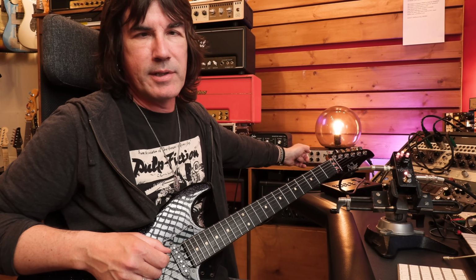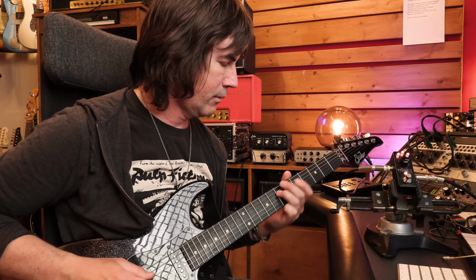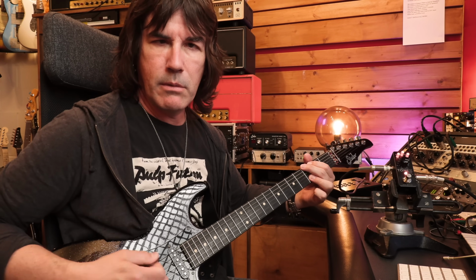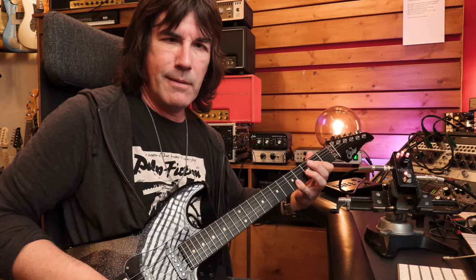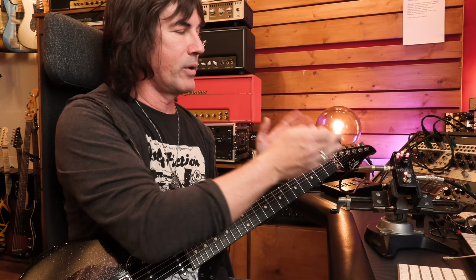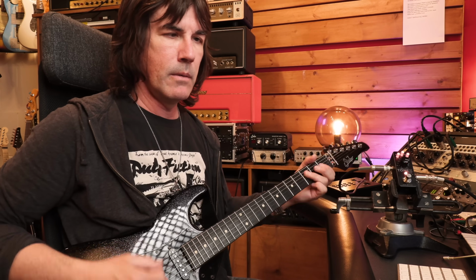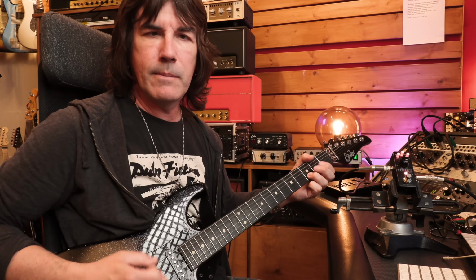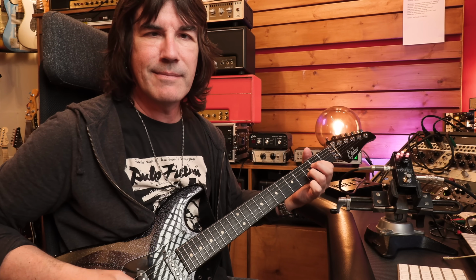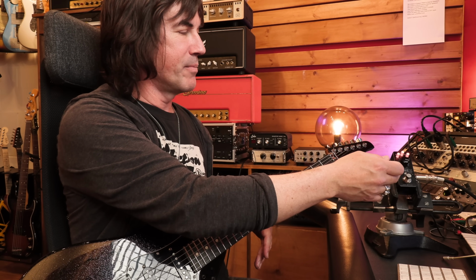I've just got the pedal plugged into the line input of my power station from Fryette there, which basically then makes it into a tube power amp. The only thing I'm adding is a little bit of echo in Logic. That's it. I mean, it's just preamp right into the cabinet out of the power amp, and that's what you're hearing. So that bypasses the pedal when I have it in this mode, and there's absolutely no tone. It's just guitar right into the power amp at that point.